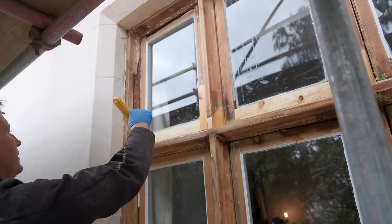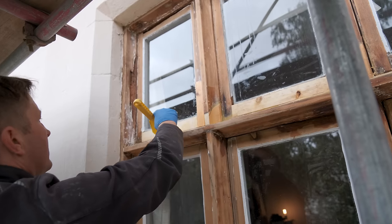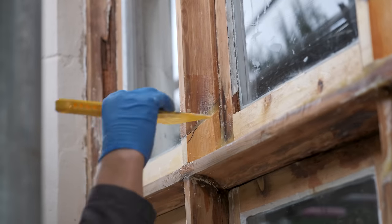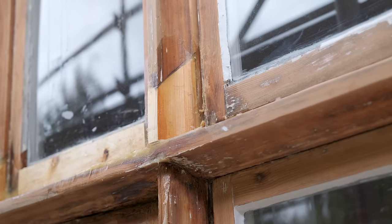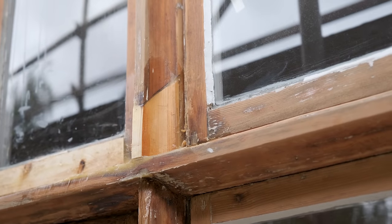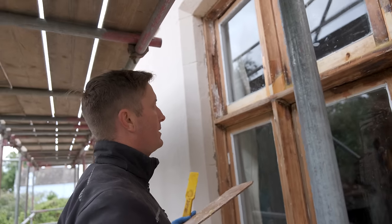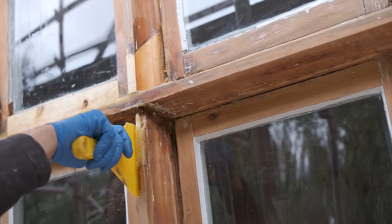What I'm just going over now — you can actually see there are cracks in the grain, so I'm literally just scraping across it, filling in those cracks. Again, we're just trying to stop water ingress — that's all we're trying to do. That one there is probably a perfect example of trailing to different lines — you've got a line to work to there, it enables me to go around that way and come down that way. But if you've got nothing there, you're just going to have to come back to it. So we're probably going to have to come back to this one either later this afternoon if it's gone off, or tomorrow when we do some finishing work. Because it takes four hours to go off, it's nice to try and get it all in one hit really. A lot of this may look a bit crude — I'm just trying to form a shape and sand it all up tomorrow. I will underfill it if I have to — it just moves about too much if it's too deep.